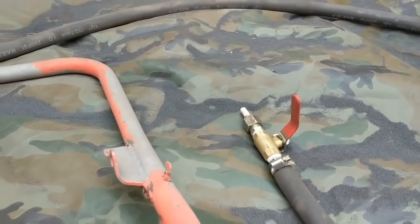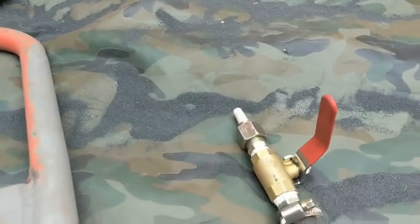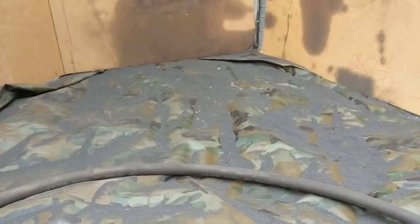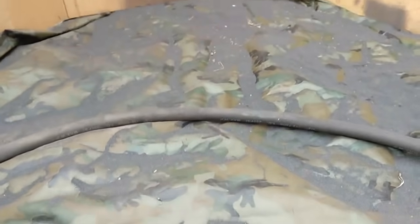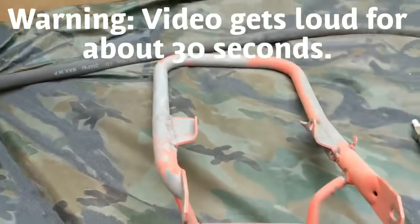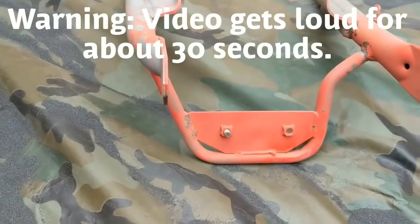And also something that is not at fault of the sandblaster itself is I had to clean the nozzle out a couple times. I try to keep my media pretty clean, but you can see how I do this here. I'm outside and I got this cardboard surround so I can kind of keep the sand contained, but you can see the debris that gets in it. So definitely filter your sand when you reuse it, because I actually pulled a couple little pieces of wood out of the tip. So that's at no fault of the sandblaster. But anyhow, I got this at 115 PSI right now, so I just want to show you real quick what it can do.